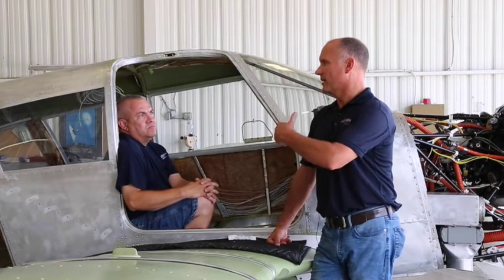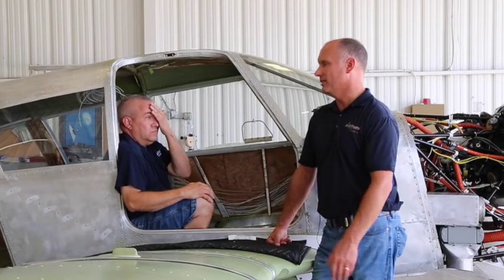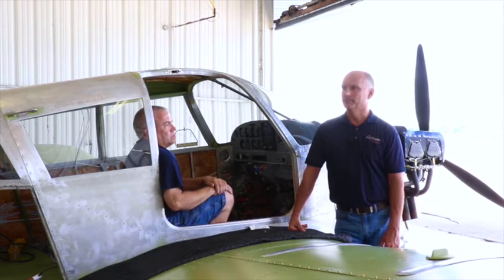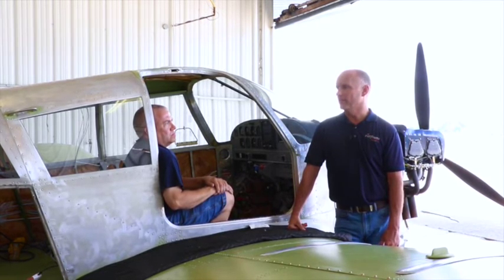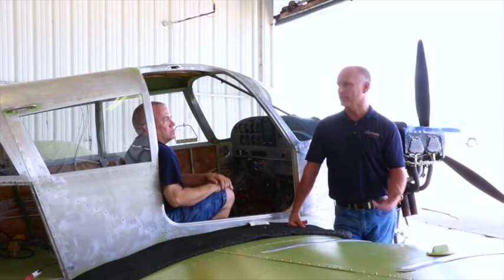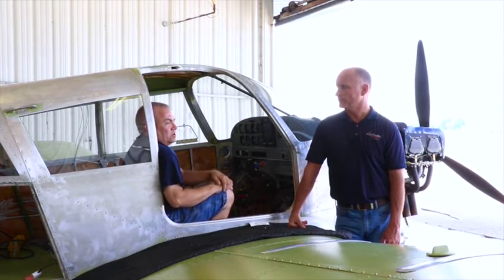On this aircraft, we put a new top skin and new belly skins, taking all the old antenna locations out — essentially giving a clean palette to start with. Is there a preferred method for antenna placement? The GPS antennas go on top, and the marker beacon goes on the bottom. You put one common antenna up top, one common antenna on the bottom — common sense, basically. So we still have to put antennas up there if we want the radios to go places.